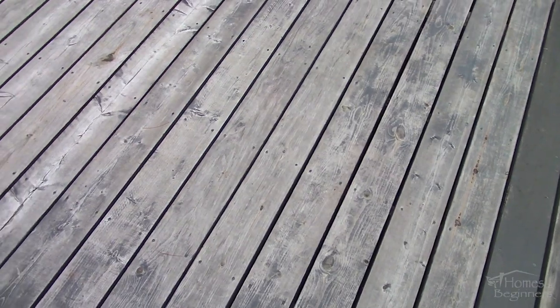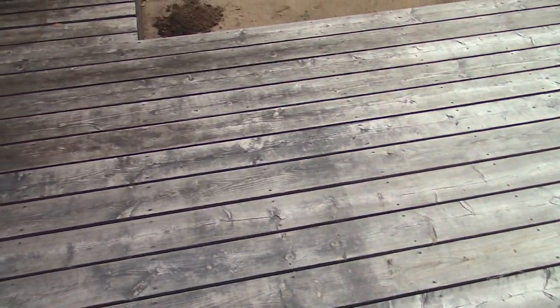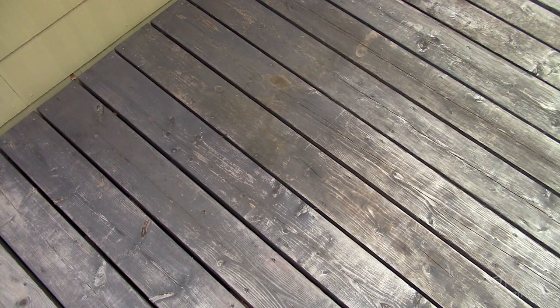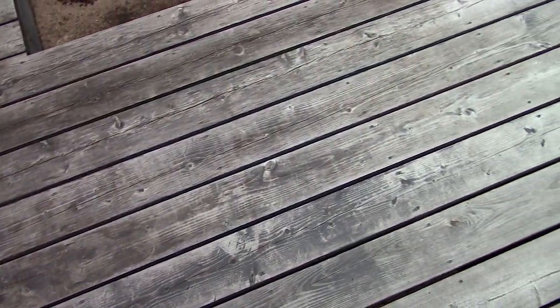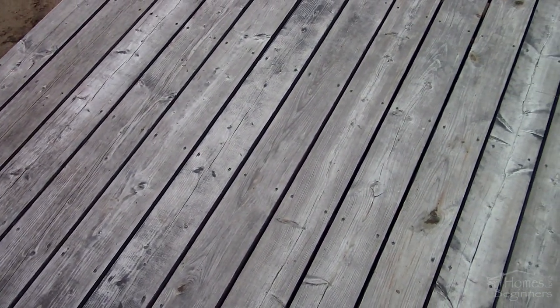Unfortunately, in Canada, with this situation due to the stricter regulations for stains and paints, some of the products aren't as durable, and this will vary between manufacturers. The old stain only lasted for about a year, and as you can see, most of it is already deteriorated. Spots such as where the barbecue was remained somewhat sheltered from the elements and survived slightly longer.